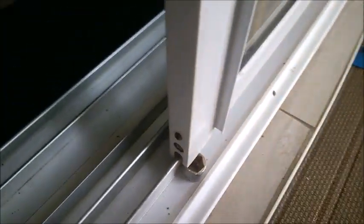At this point the weight is off the wheels so it should be easy to rotate it clockwise. I'll lift the door and use an impact driver — you can use any screwdriver. Let's do a check. The top here is about one millimeter. At the bottom it's still too much, so I still need to lift it some more. But already the gap is smaller, so that rotation did help.